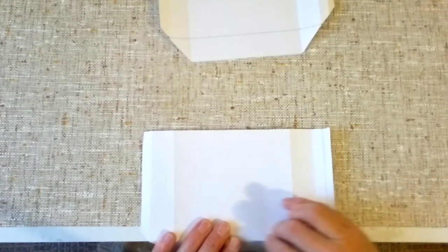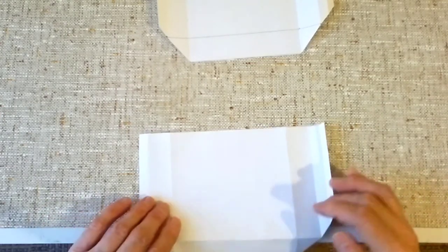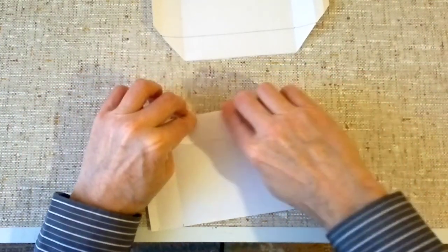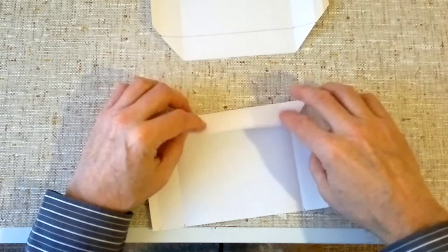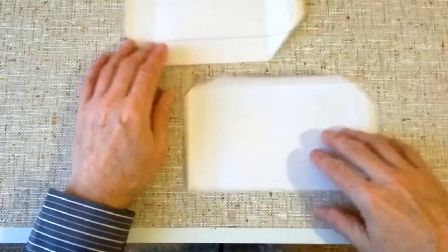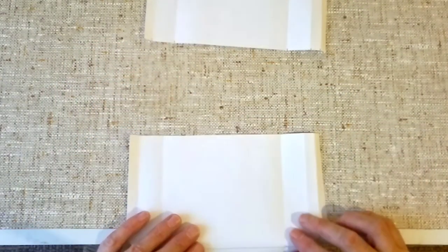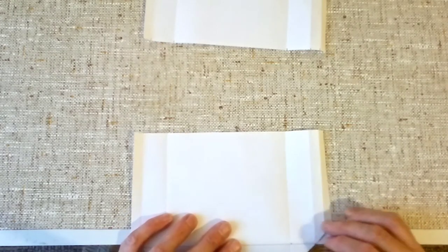Right along the corner we draw the bend line. Everything the same on metal. We bend it. Here is our 30 mm edge — ready. The same we now do with the upper paper panel. No trimming needed here; we just need to make notches because the line is clearly visible. We just need to mark it with notches on the left and right sides.